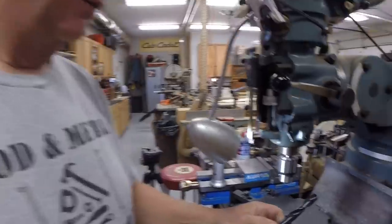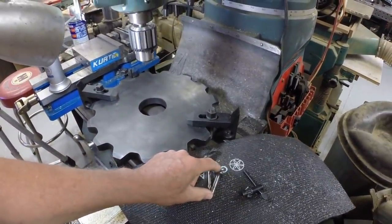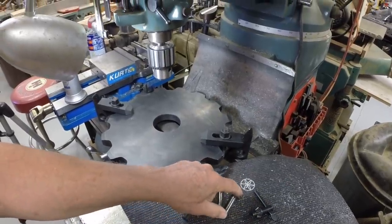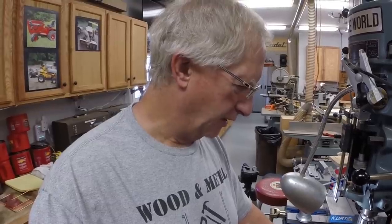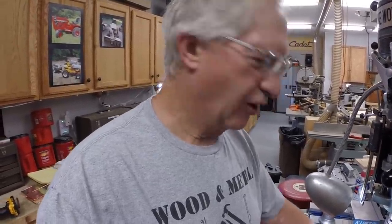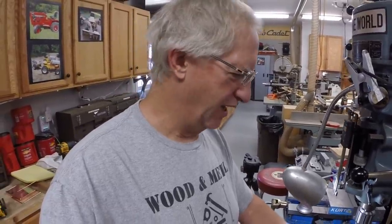I've got a brand new 5/8 inch bit, so it's good and sharp. Then I'll come back and switch it and chamfer the holes as I go around. The chamfer is for the lug nuts, which, as you know, have a taper on them to seat. The bolts are actually half inch fine thread, I think half inch 20. Anyway, we'll see how hard this metal is. I don't know whether it's been tempered. If I have trouble drilling it, I'm going to have to get a carbide bit, and that may be in the next episode.